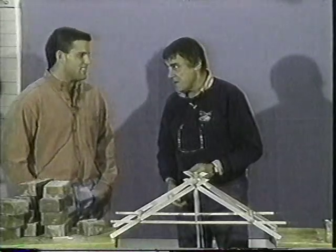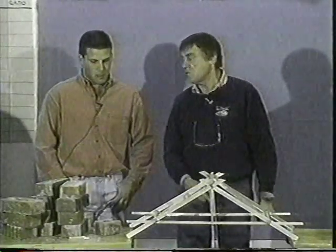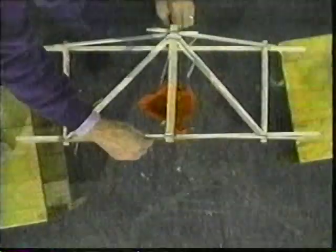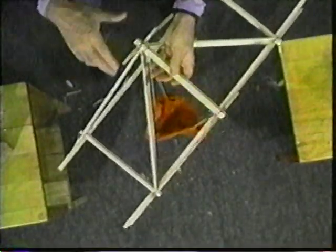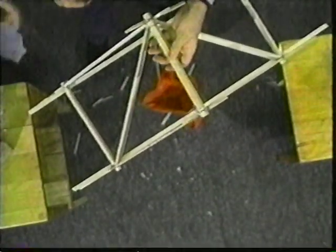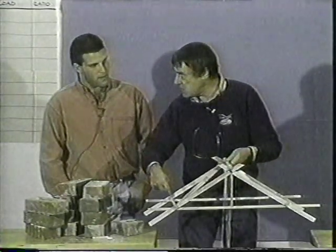The weight is 96. One might have been able to relieve the weight — obviously balsa wood can take tension, but so can string, and that weighs a lot less. It's very wide in that configuration. You've braced it on the assumption that it's going to distort in that direction, and that's going to go into compression. If it distorts in the other direction it's going to drop out. In tests it always went this way. Well, if you put a string across there it would have done the same thing.